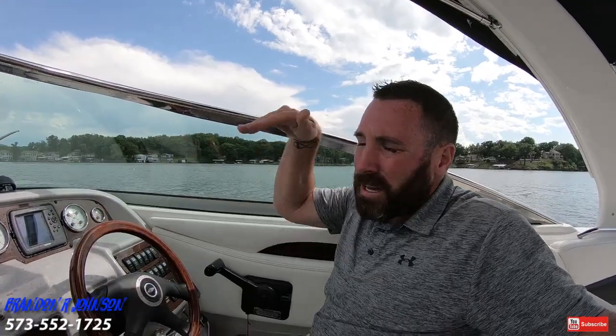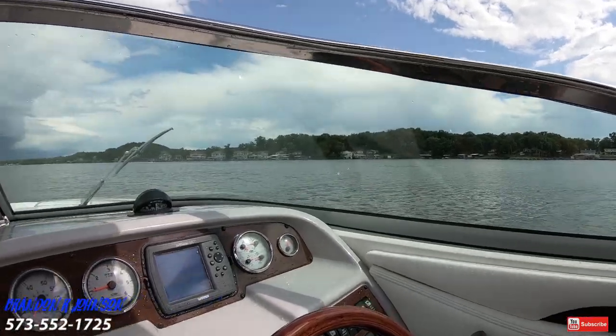I want to teach you quickly how to operate trim tabs though, because that's what we're doing, a video demonstration today. So, always pick something straight in front of you before you start messing with your trim tab buttons. If you're turning when you're trying to set your tabs, it's a functional oxymoron. It will not work. Tabs are in the back of the boat. They're levelers, and there's buttons right here I'm going to show you, okay? So you can control one side or the other side. If you have too many people sitting on one side and it leans, hit the other side to level it off, vice versa. When the water is rough as all hell, we just put them both down at cruise speed, around 30 miles an hour, keeps that nose pushed down and plows through the rough waves. But for this purpose, let's talk about how they work.